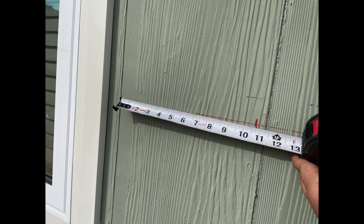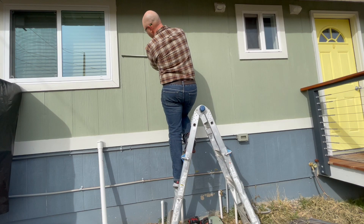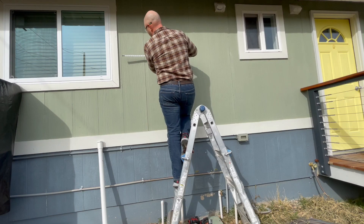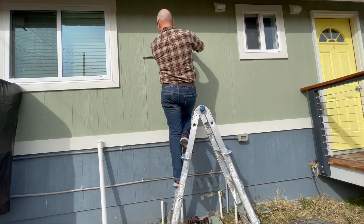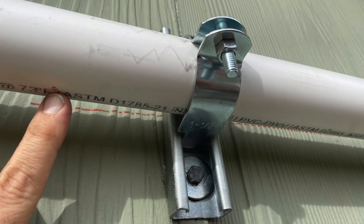After that, you'll see that there should be about 10 and three quarter inches of clearance to the T part of the header from the end bracket, and then from the other bracket there should be about eight and three quarter inches to the end of the header. But these are general and have a little bit of wiggle room. Mostly, you want to be concerned with not covering up the emitter holes on the header pipe with the pipe clamps.